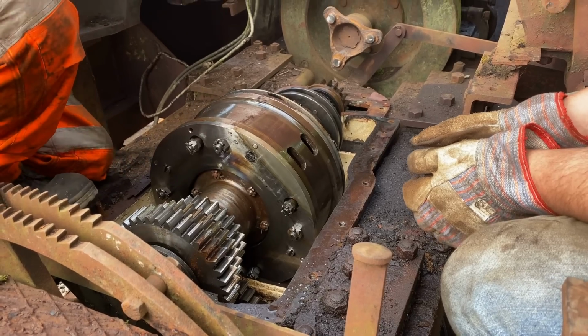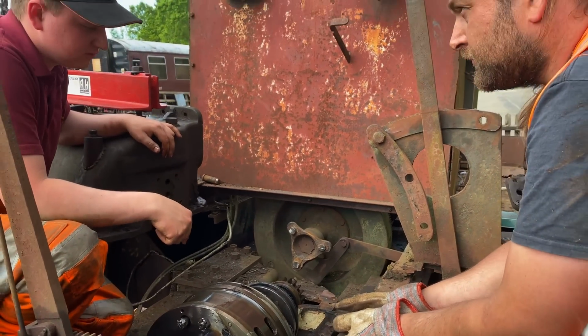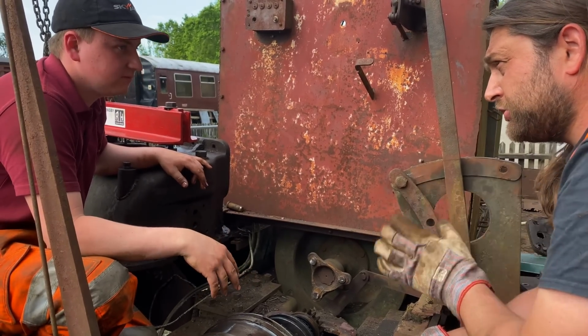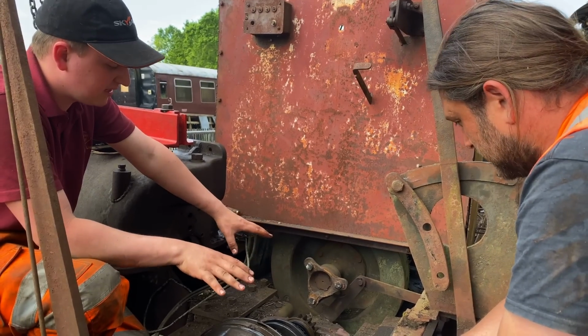It doesn't. So before you start this up, you need to shut the pipe. Shut the tap. When you turn it off, you leave it open, so it will balance, and then before you start operating, it should be shut. So there is always, in theory, the same level of oil in both gearboxes.